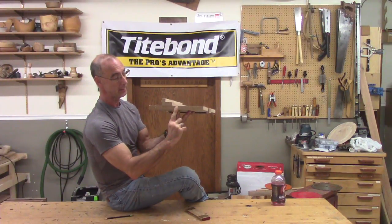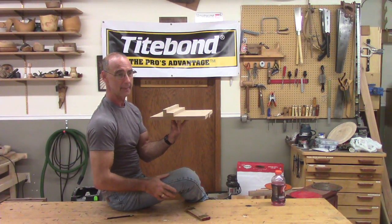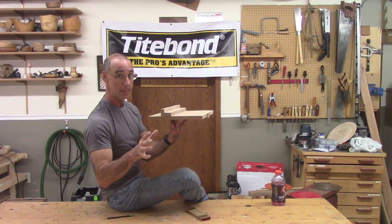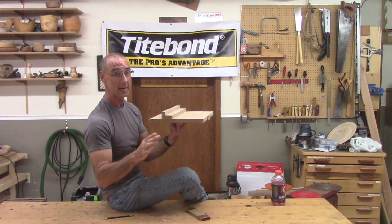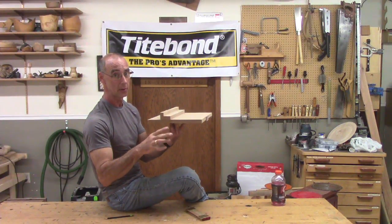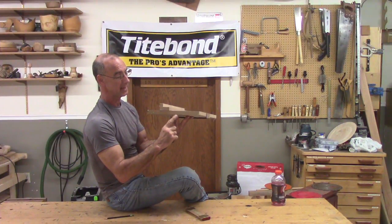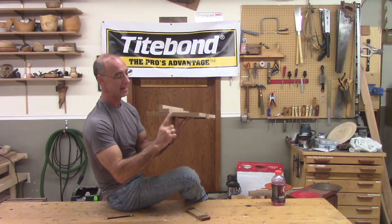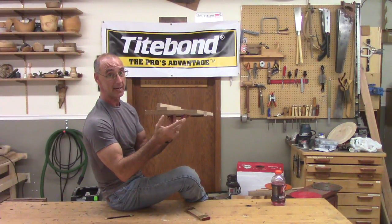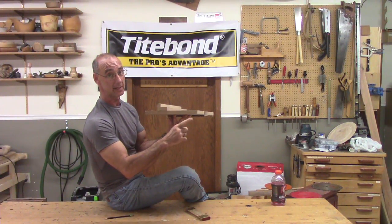But the problem is the porosity of these edges. I once did cabinets for an office. It was all going to be painted, so everything was MDF. The cabinet cases, the face frames, raised panel doors, drawer fronts, everything was MDF. The key to making that work is that before the final paint goes on, you need to do a little bit of sanding. Sand these to about 180 or 220 grit, and then you need to seal them.